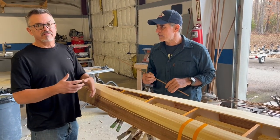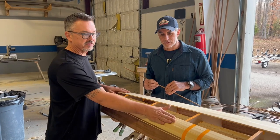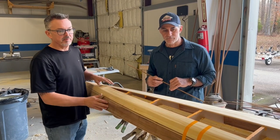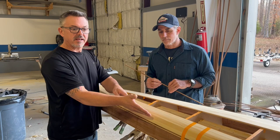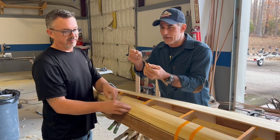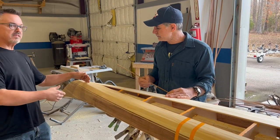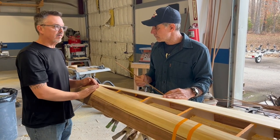Because we were using strips that are half the width. We used them in order to make this bend, because if we used a full-width strip it would end up being more of an octagonal stepped kind of shape, and we didn't want that. So we ended up taking the strips, cutting them in half, planing them — basically a little thicker than this to come around the corner. So we stacked three. They had to be each individually shaped, and then tapered on both ends to fit within this area here.